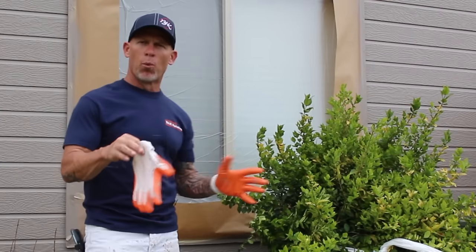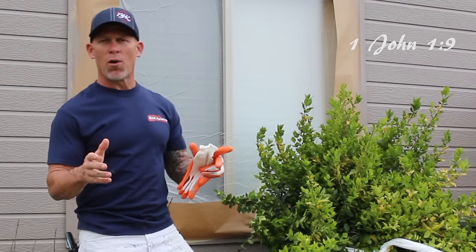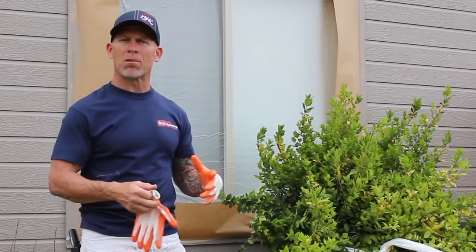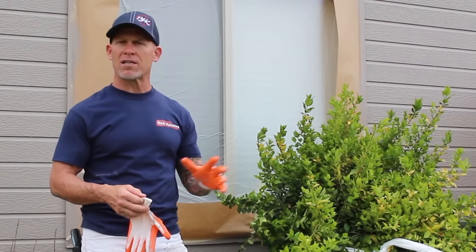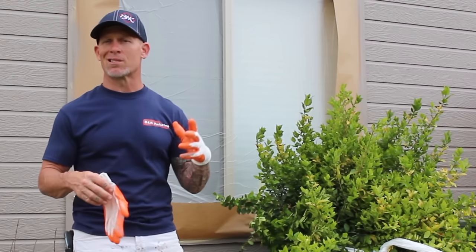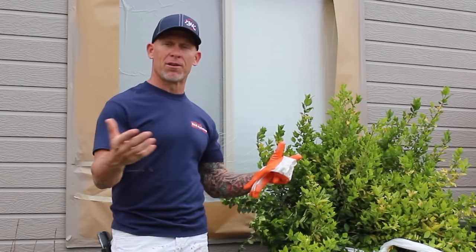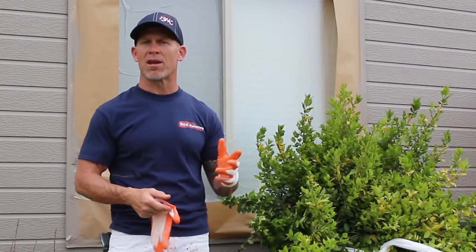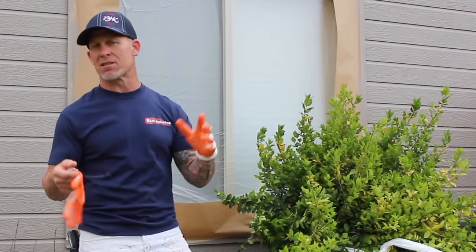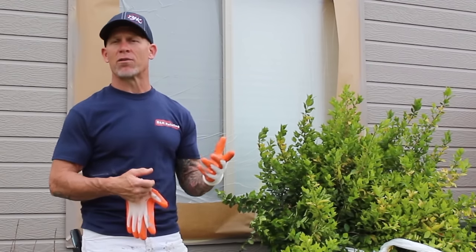You'll definitely get questions about wind when you're spraying and overspray on windy days. If you know how to correctly control your overspray — with your cardboard shields, your plastic, your drop cloths, and just turning down your pressure a little bit when it's windy — that doesn't stop us from painting. We continue to paint; we're just more conscious about controlling overspray. I've never once had an overspray claim in my career with my company B&K Painting, and I've got tens of thousands of hours of spraying — which has given me the practice of controlling overspray and not getting it on stuff.